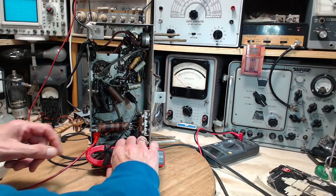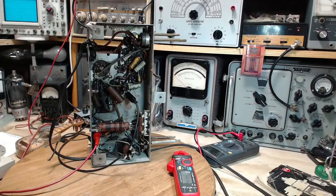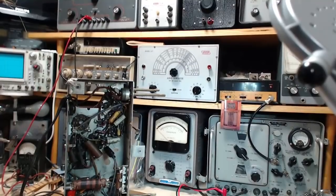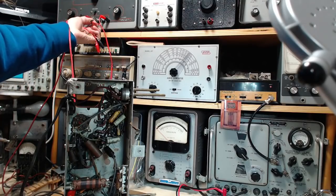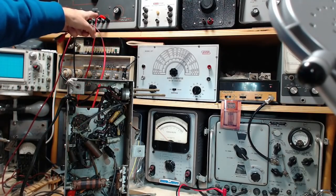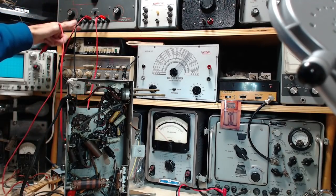Now we put a little high voltage on this baby. Okay. I'm going to cut that off. Heater's off. Don't touch these wires, Jim. Okay. Now we got to bring 2 more wires down for the high voltage DC. Put them on the supply. The red one is positive. So this is where the black lead here is common with the red lead here.